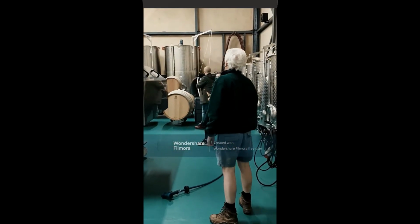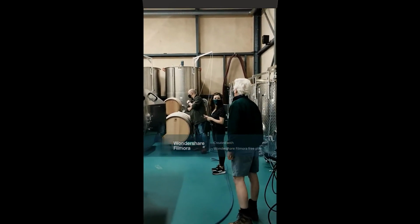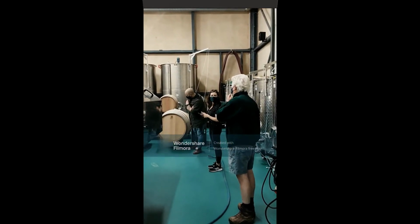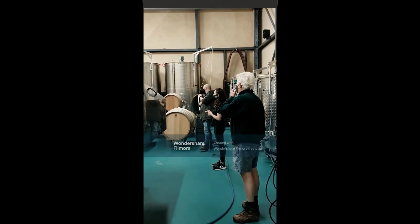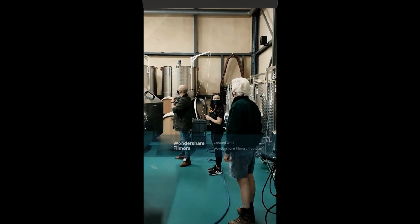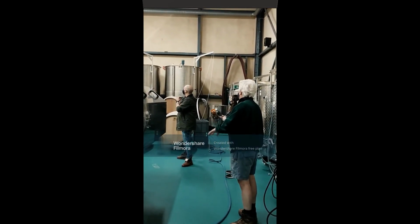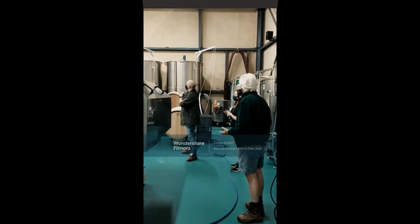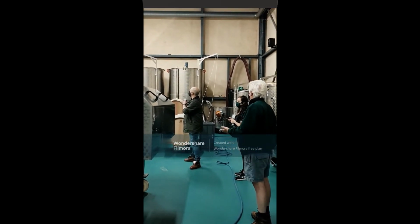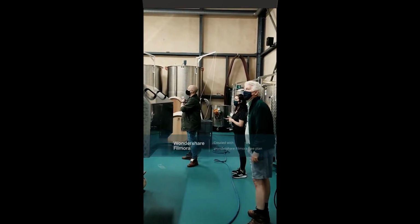The big stainless steel tanks are used mainly for bottling, storage, and settling as well. So you saw there's a tank outside. In October, once we press, we plug it into a tank outside, and the sediment will settle much quicker and more efficiently in a cold environment. It's too warm in here, 15 degrees. Even October, November is still 15 degrees in here.